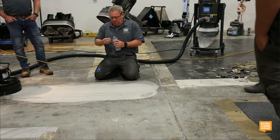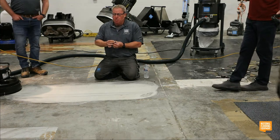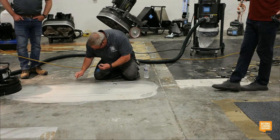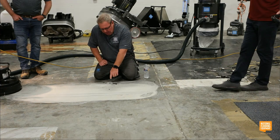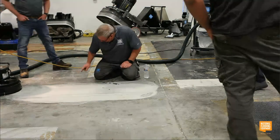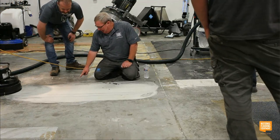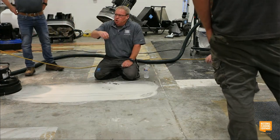This is not my test. It has been around for as long as I can remember since I started, and that was a long time ago, you guys. I'm almost 50. Take a drop of water and drop it on the floor. I'm sure the camera probably isn't going to show this, but you put a drop of water, and after 10 seconds, it should grow as big as a dime, give or take. If you look at my drop of water, which I can't see, I'm blind, right there, it's just sitting there. So I have not opened this up at all. Here you can see it is soaking in.